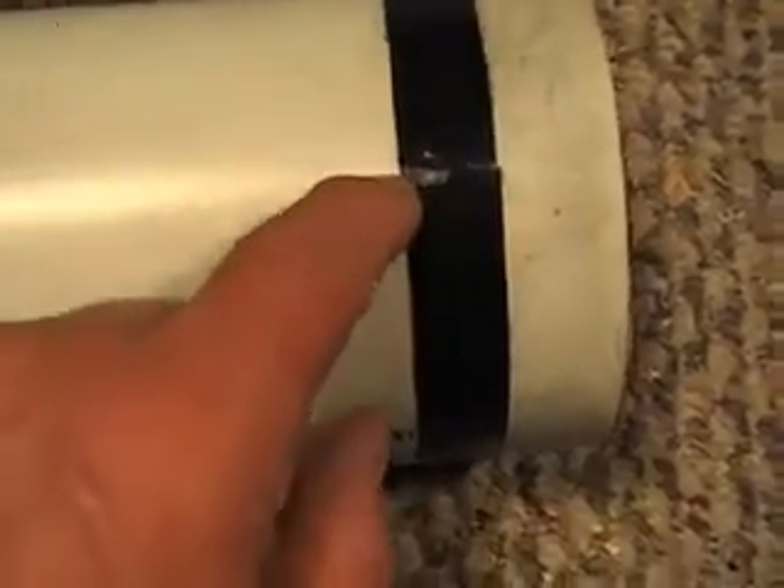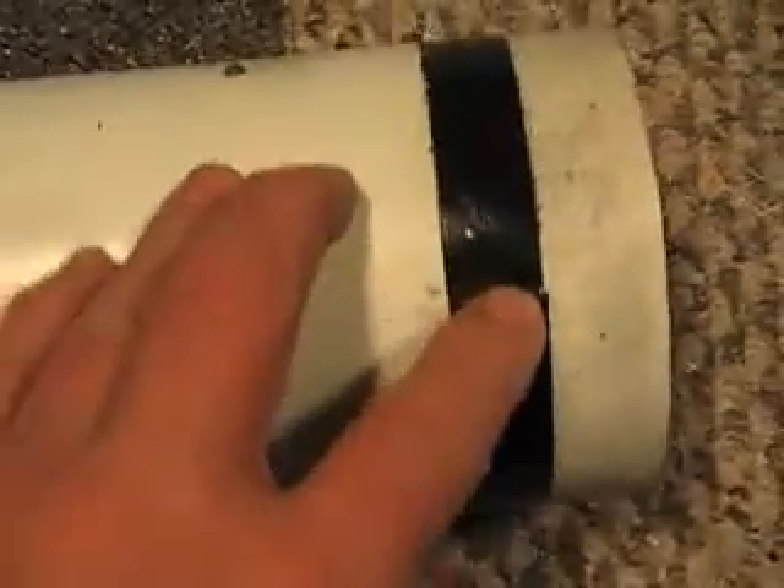After cleaning and drawing the line, I took electrical tape, pulled off a big strip without cutting it. You don't want to pull it tight or leave it loose - just lay it on your line and gently walk it around. It ends up absolutely straight. When I got back to the start, I folded it over and took a razor and gently cut into it at the seam, so they married up perfect. That allows the cap to slide on and make a damn close to airtight seal. I actually hooked these things up to a vacuum cleaner and walked around them with a piece of burning paper producing smoke, and there was nothing being pulled in.